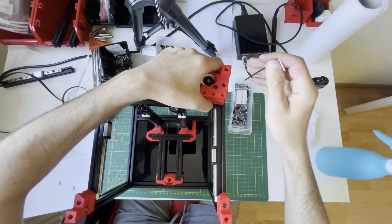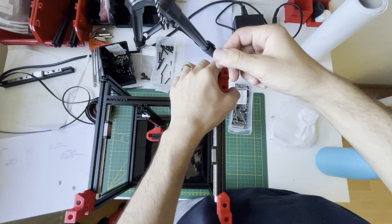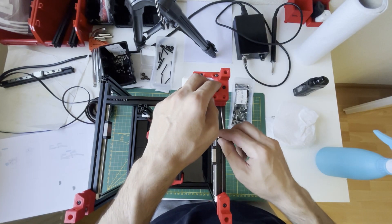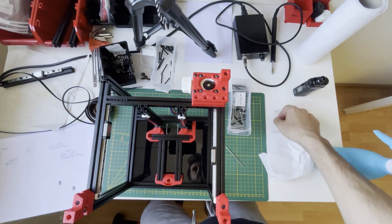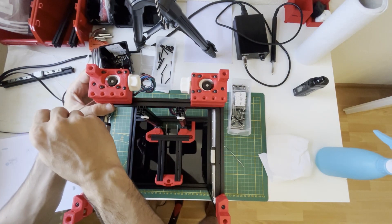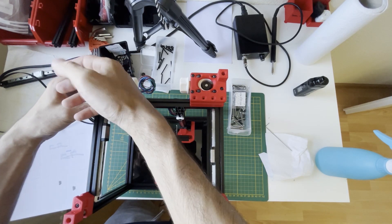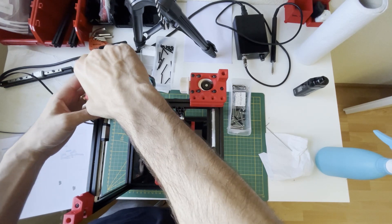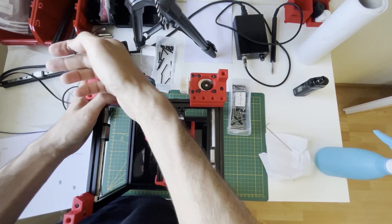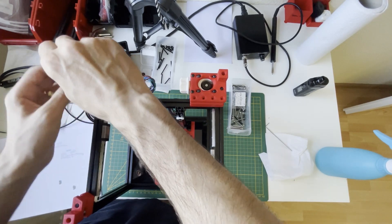For AB drives we will use one of the pre-tab frame pieces for the corner. This tightening screw should look inside the printer, and with one hex nut we will tighten this. To make it easier: take one hex nut and first align the hex nut with your screw roughly. Then try this screw — it should attach the hex nut. Don't tighten yet, just check if it's grabbed. Then tighten this threaded insert — the corner screw first, not fully but firmly. Then firmly tighten the bearing second screw. Then do the last tightening.